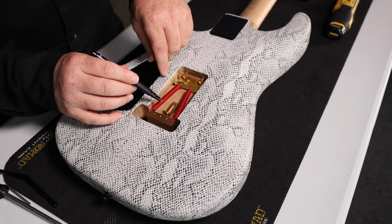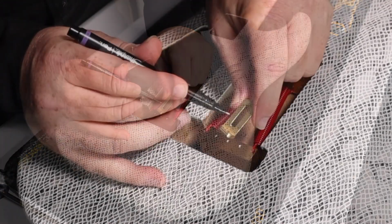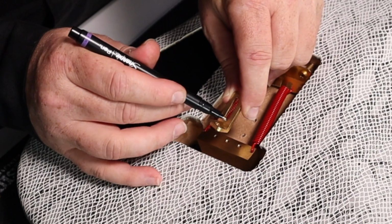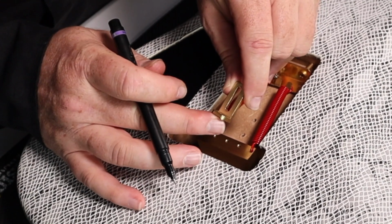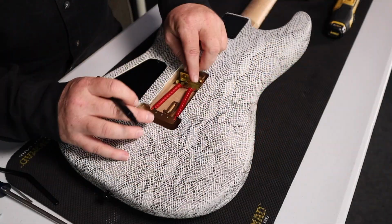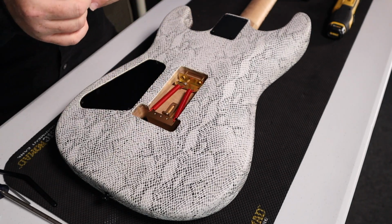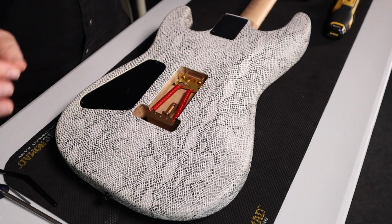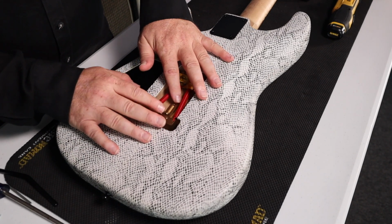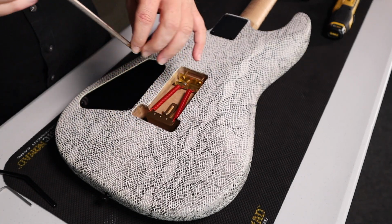From there, you're going to mark two holes of where you're going to put your screws. And for the front hole, I suggest you put it right up against this U here in the route. So when the stopper pushes back, it's up against the edge. Once you have that set, mark the two holes. You could drill two small pilot holes, 1/16 of an inch, if you like. Sometimes I just shoot the screw right in there. Use the silver mounting screws.